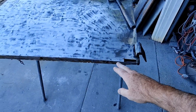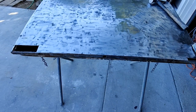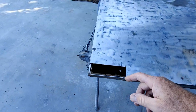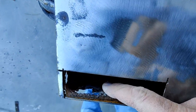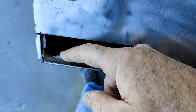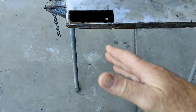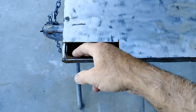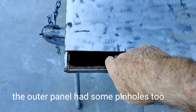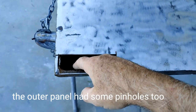Check this out — these door bottoms didn't look that bad until I stripped the door. Then I saw inside there: a rust hole in the inner panel, so I just cut it open to take a look at everything and see what's going on — how heavy the surface rust is on the inside, which isn't that bad.